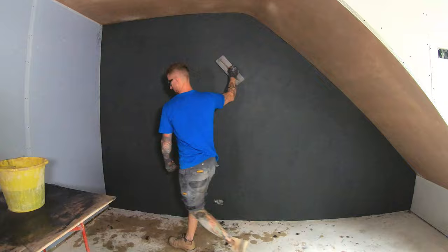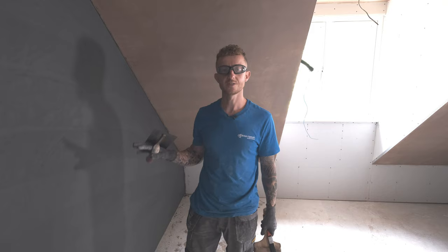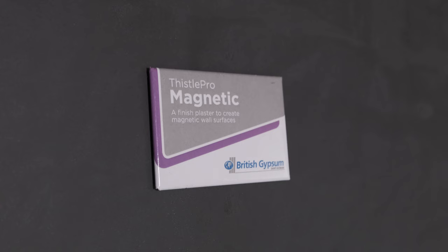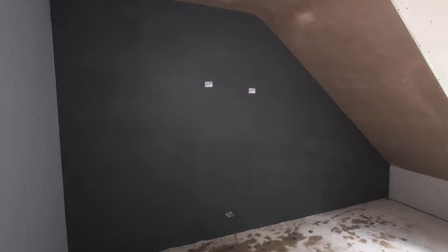The wall is completed. Once it's finished like this it will just need to dry the same as any other plaster. When you come to decorating, you do not need to apply any additional additives before you paint — it's exactly the same as all of the other Thistle plasters when it comes to decorating. This is what you plastered it for — it's magnetic! Awesome stuff. I'm John from A&E Construction and this has been How To Plaster With Thistle Magnetic.